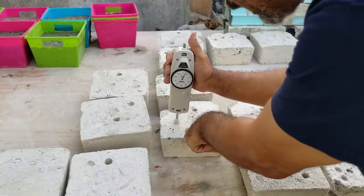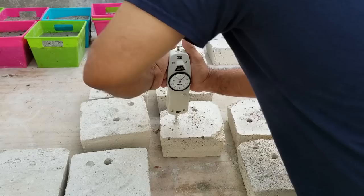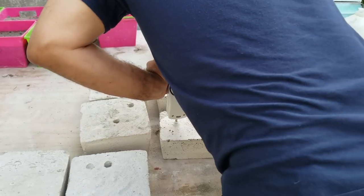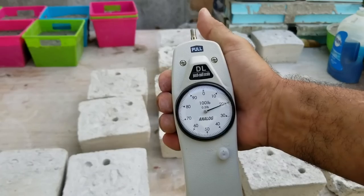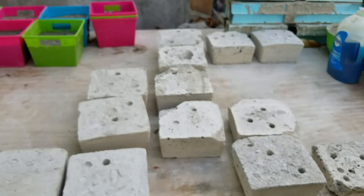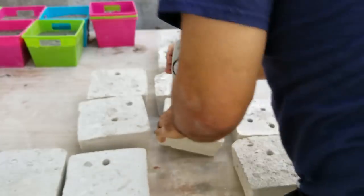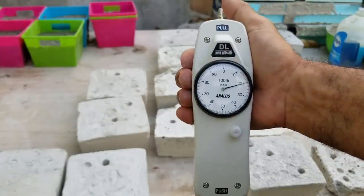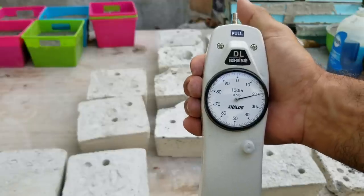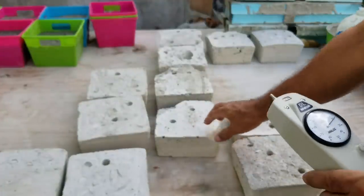This is our 50-gallon mix with cement accelerator in the foaming solution. It had four ounces of cement accelerator in a five-gallon bucket with foaming solution. It's pretty much as hard as I can push down on it — I'm maxing out my gauge. We'll just say that's 120 pounds of force. That's a very strong, very good mix.